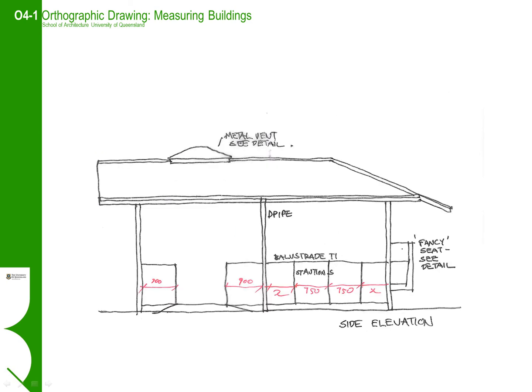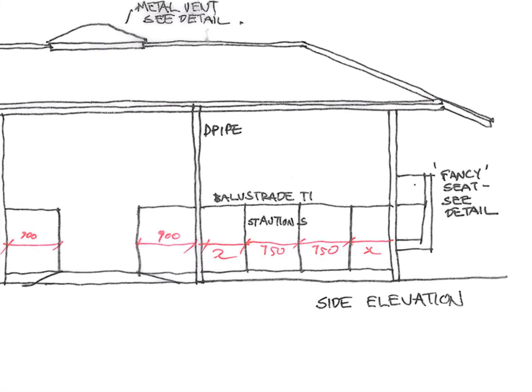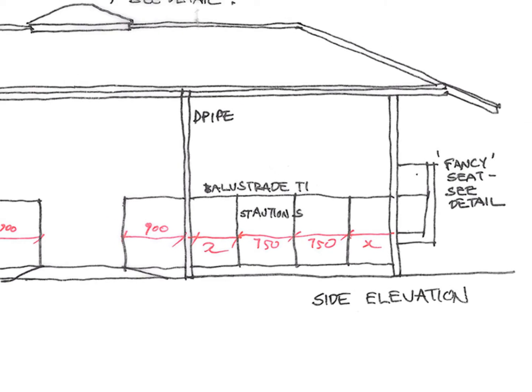The elevations are important to bring all of the main parts of the building together, but they can be tricky as overhangs can sometimes make the structural set outs unclear. You would typically construct the elevation from your plan and section drawings, so make sure that the plan and section drawings are thoroughly drawn and dimensioned. Elevations typically don't have many dimensions on them, but they do show how the elements are proportioned and how they come together overall.